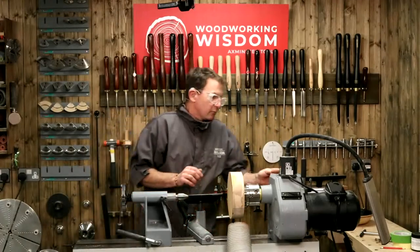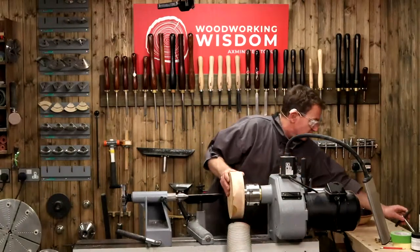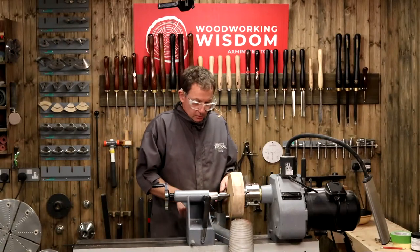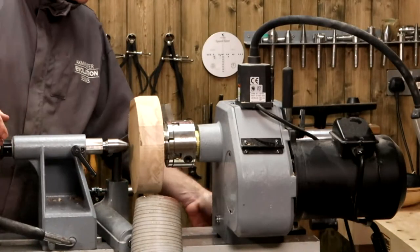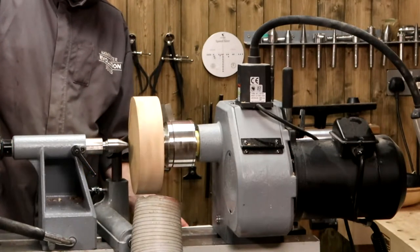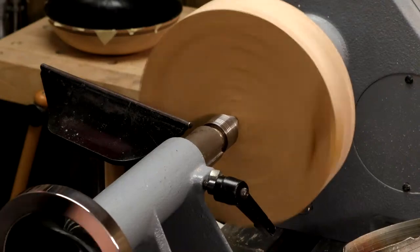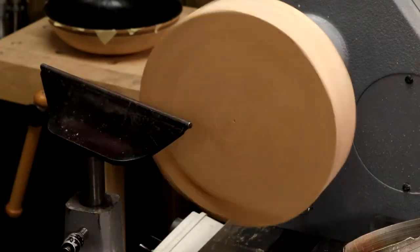So a bowl, as we've said, we've got our screw chuck. Now the blank, let's just check things are tight on the screw. Just going to bring the tailstock up. We're obviously going to do the outside first. I'm going to make a mark and then just drop that back. Speed wise, we're loading something new, so let's just take the speed down and bring it up. I want to go forward, so let's flick it over. That'd be better. Going to use the tailstock just as a bit of support in a minute, but I've just made a mark.